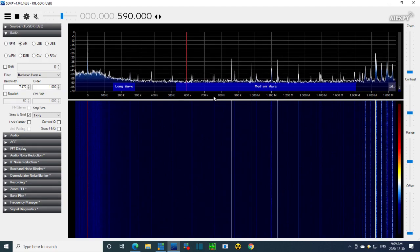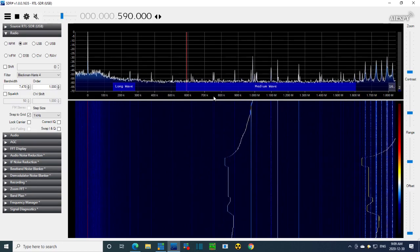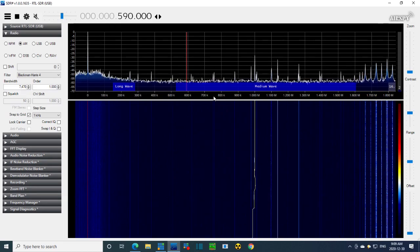Okay, that's good. Let's put one on a nice number. Put the local oscillator. Why am I mixed up here? I thought that was the signal generator. No, I'm wrong. We'll put the local oscillator. Hey, how do you like that? Now, what did that mean? The local oscillator at a million. Now, it's 25 kilohertz below, that's the signal. Is that making sense there? Well, oscillator at a million. Yeah, you can see it there, 975, exactly.